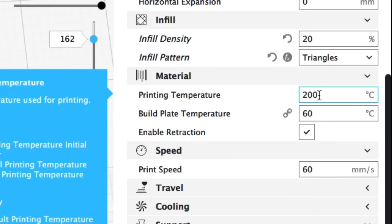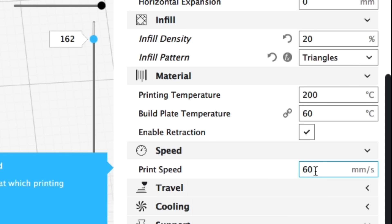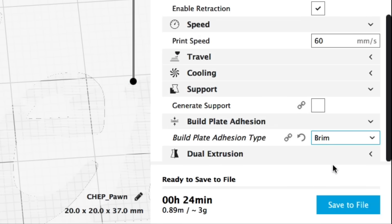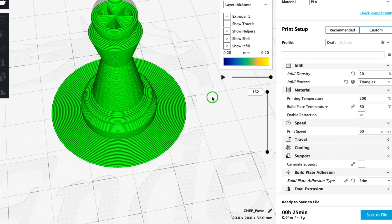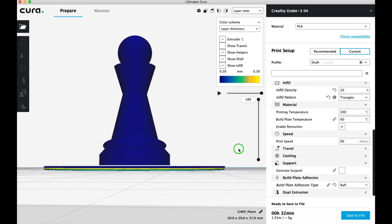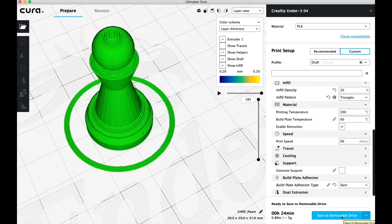There are other settings you can change, like the temperature for the material you're using, which can vary depending on what you're printing with. The temperature of the bed makes it stick, and the print speed — you can print slower to get better results or faster. There's also how it sticks to the bed: I had a skirt going all the way around it. You can also do a brim, which will help prevent warping, or print a raft if your bed isn't exactly flat — it prints a little island that your part gets printed on top of. These are just some of the settings you learn by using your slicer. You can save it right to the SD card and it'll say eject, and now the SD card has the g-code file and you're ready to print.